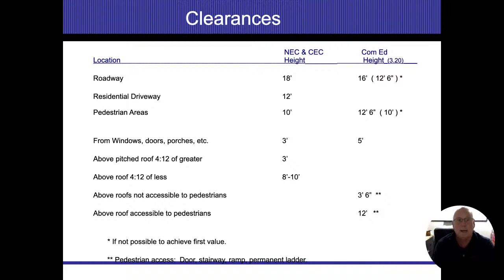All right, so as I measure that, if I'm standing in front of a window and I'm looking out, we're going to go from the one side to the front to the other side to down below us. That's all 3 feet. 5 feet for the local electric company here in Chicago, but 3 feet for the NEC. That doesn't include above, all right? I could be right above the window. I can't be in front of the window, but I can actually be right above it.